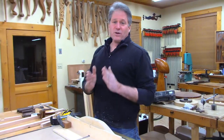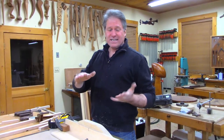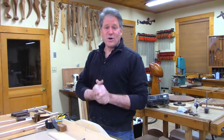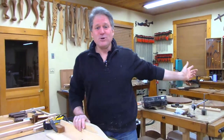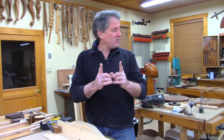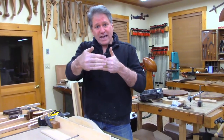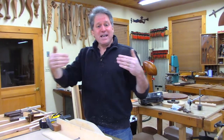Yeah, if it's really wide, you do. And if it's plain sawn and it's a wood species that moves quite a lot, I was actually thinking about that when I was showing you the walnut table. I hadn't looked closely at that base. That base, if I remember right, is about 4 to 4.5 inches. I think it's a 4-inch. Yeah. And so you've got 4-inch wide material cross-lapped. So it's moving across the grain direction, but it's not moving at the length. So with that cross lap, it's fixed in one direction, and it might want to move in the other way.